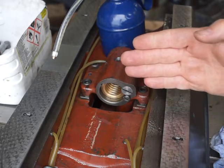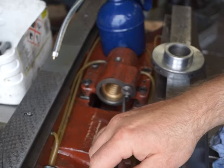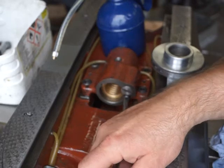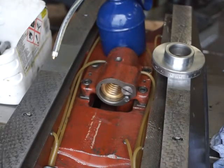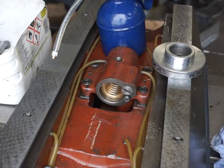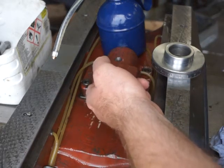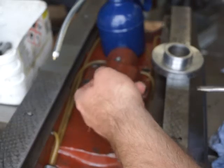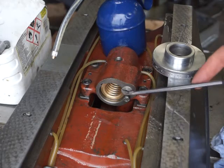The screw can actually bend out if that's the case. That's the locking one there, and this is the adjusting one here. If you unscrew these four screws and find there's a lot of movement in your lead screw — going left to right, or forward and away from you in the y-axis case — then these will need adjusting.